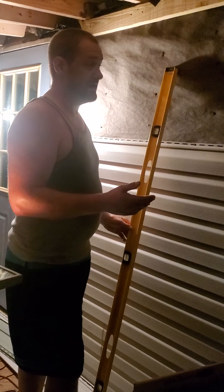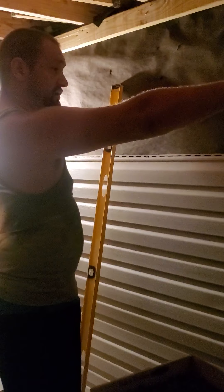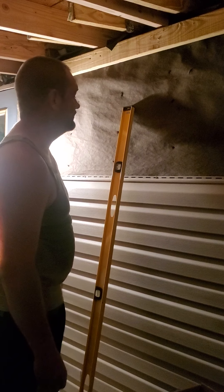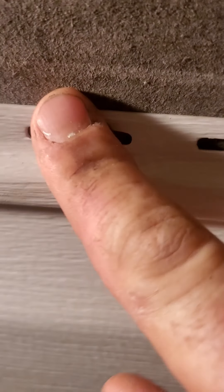Building is an illusion. Plywood and drywall are four-by-eight sheets — if you're sheeting by yourself, it looks perfect. We've got a nice tight siding here. I might have taken that nail home a little too far, but that's about right. I try to keep the nails in the middle of the slot so when it expands and contracts, you're in good shape. You don't need that much wiggle — about a quarter inch for every six feet or so. I've never had a problem with them.